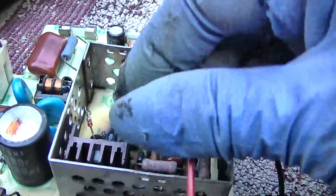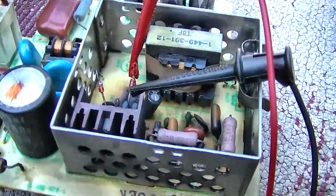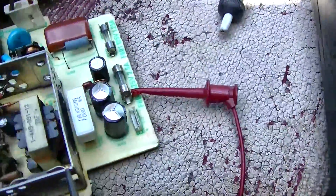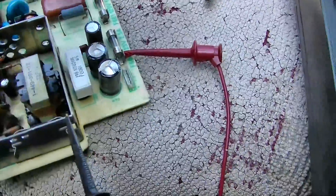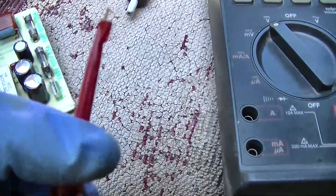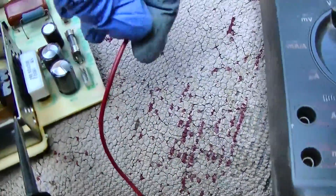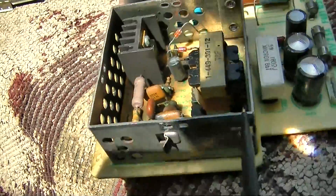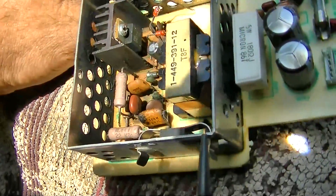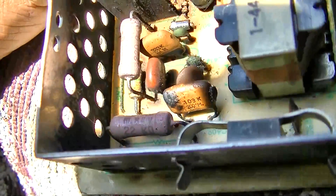Let's see what our voltage is. Look at that thing — it's getting so hot so quick, it's melting my clip lead. We've got 23 volts on the output. That's run away even with that. That stupid thing got so hot it ruined a 12 or 15 dollar Pomona mini grabber — this is not Chinese junk, this is legitimate Pomona — it's ruined it. I was looking at the schematic and I have a feeling one of these capacitors is bad, causing the whole thing to run away. See that capacitor right there that says 103 on it? That thing looks baked.